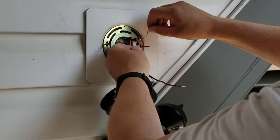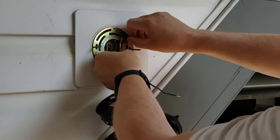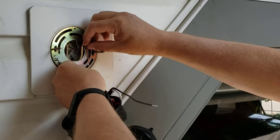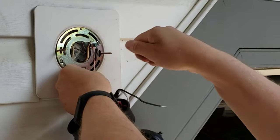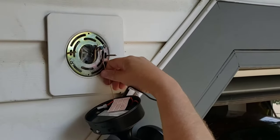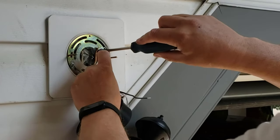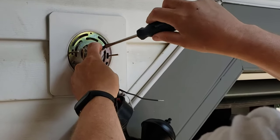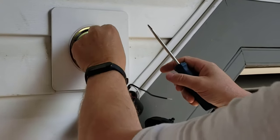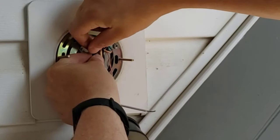Before you do that, connect your ground which is your tether. Whenever you're working with wiring you should know to always wrap the wire around the screw going clockwise — in the same direction the threads are going. The reason is that when you screw it down you don't want it to become loose. Make sure it's all connected and secure. That's tethered — great.